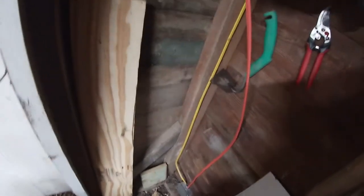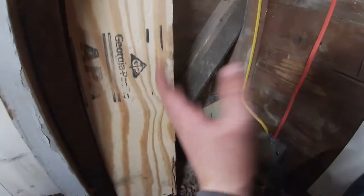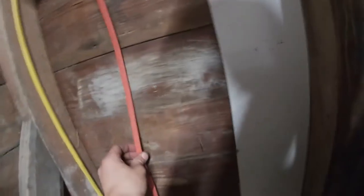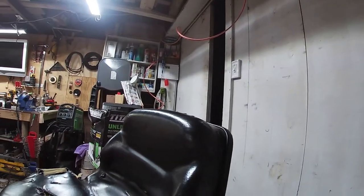Just a little recap on what I did: I fed the wires through the conduit and put both caps back on. One end of the wires is in the basement. At this end we have a junction box so that if these wires get damaged in the shop, you won't have to run them all the way back to the conduit. There's a splice there, and we've got this wire going over to where I want my outlet. Now we're going to staple this to make it look nice.